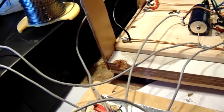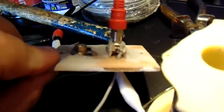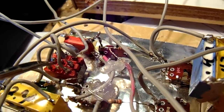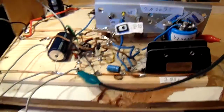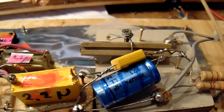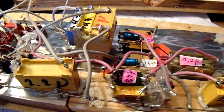So that means that this setup from this amplifier is healthy. Perhaps I get some hum when it's mounted definitively, but then I'm going to shield the cables to the input — and of course that has to be done when it's necessary. Perhaps it is not necessary. So that was something to tell about the construction techniques. Here I can swap the left and the right channel, but it doesn't function at the moment because I only have one channel — one end amplifier and one pre-amplifier functioning. I can't give a sound demonstration because I don't have good music that has the full richness that I need for such a demo.